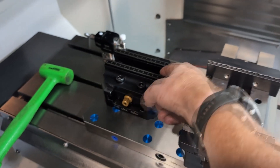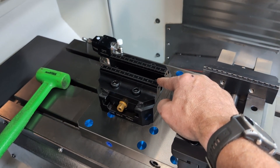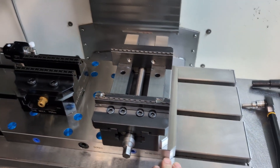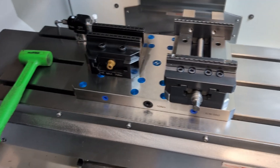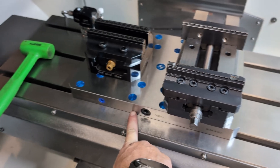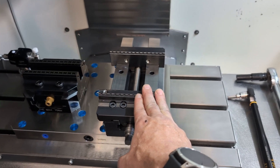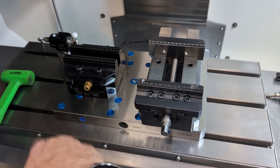Another thing with this vice is these vice jaws aren't parallel with each other in the relaxed position. When I put a dial indicator on after I tram this in, I could never get each position to run zero like the other position. When I put this vice on, I dialed the front of this in to running zero, put the vice in, and then I was only two thou off in each position.